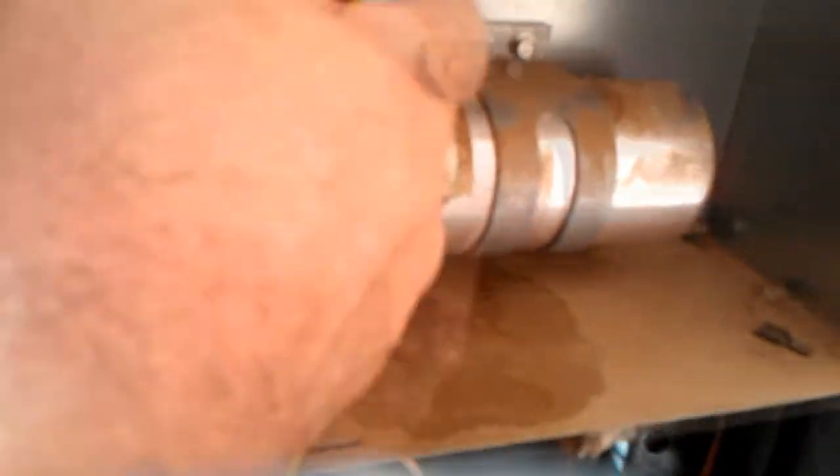It jumps over to the contactor over here, so I'm just going to put that wire right there. And then the yellow striped wire on the 521s goes on the start winding of the compressor, which is the same terminal where the blue wire connects on the HERM of the run cap, and goes down to the start winding down there. Should be all set to go.